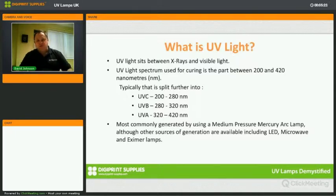The most common way to generate UV light for curing processes in print is using a medium pressure mercury arc lamp. It's essentially a fluorescent bulb that's a bit more powerful with different things inside it. There are other ways of doing this, including microwave-generated lamps — a company called Fusion produced a lamp that generates UV light using a microwave-like process. There are also newer technologies such as excimer lamps and LED systems, which are just different ways of generating UV light.